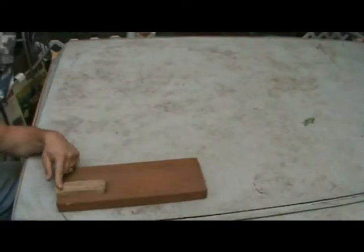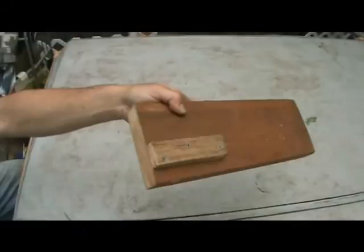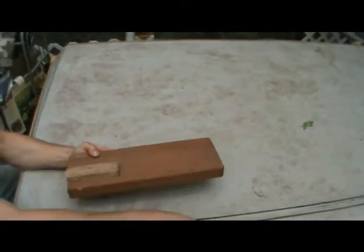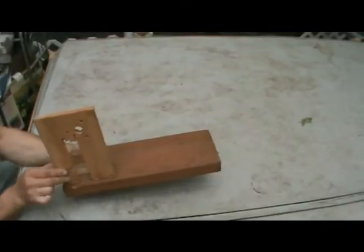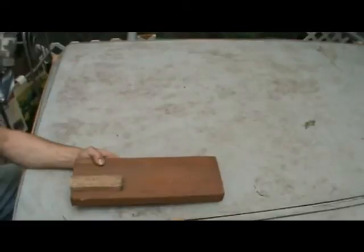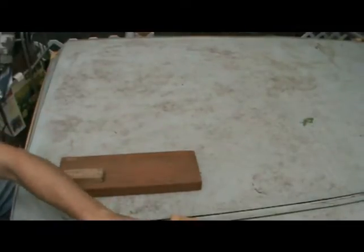Next step, once you've got your three screws in, I'll hold it up close to the camera so you can see kind of what it looks like. As far as distance in, you're going to want to go with about what the thickness is of the board you're using for your mount, or a little bit more. In this case, I've gone with about 1 inch. Okay? So the next thing you're going to want to do,